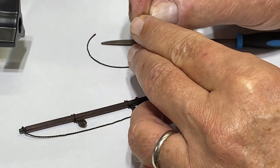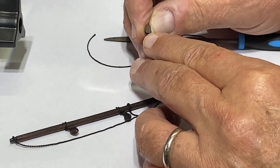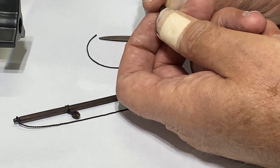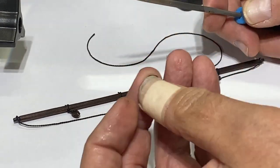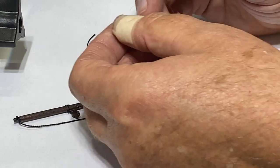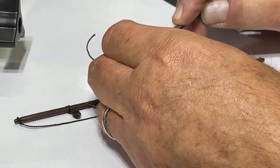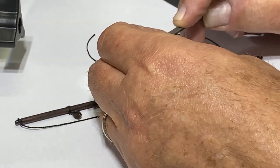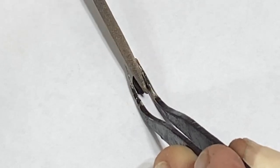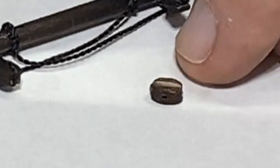While I'm here I want to discuss these pulleys. You're probably not going to be able to see on camera, but there's a groove on one side that did not come through on the other — really it should be on both sides, as well as on at least one of the tops. I think it's just a matter of the laser not cutting it completely. What I've done is take a triangular file: where one side already has the groove, I transfer that across to the other end, then go to the back side and make that groove in the center on the back side as well.